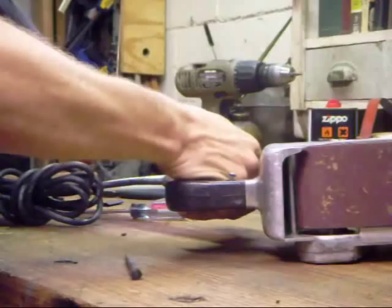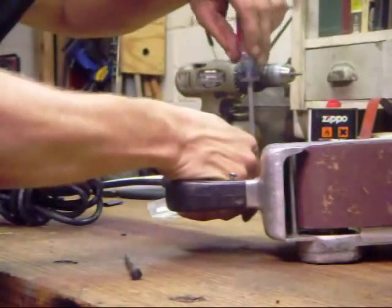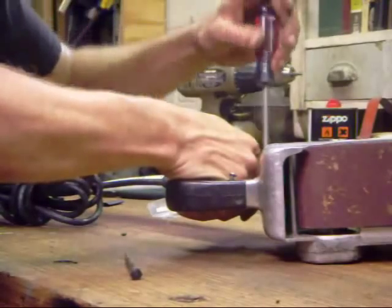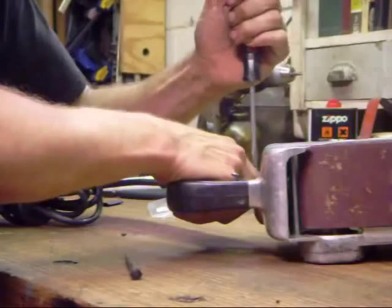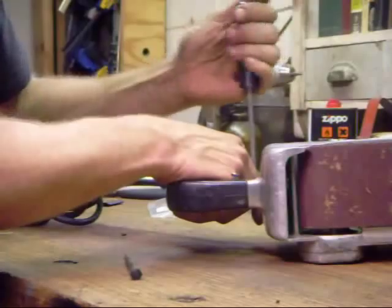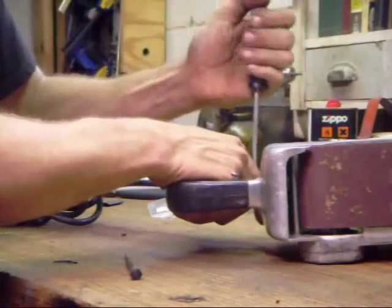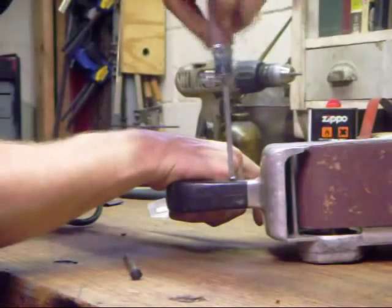The handle half is going to clamp the cord down. It's important to make sure that none of the cordage is sticking out anywhere — no exposed wires, nothing that's liable to get pinched, because you can actually cut through the insulation on the wire, and that's a big no-no. So we're going to tighten down our screws to the sander housing.